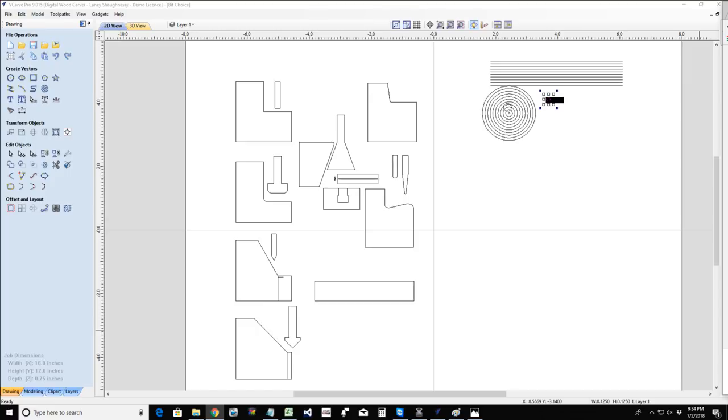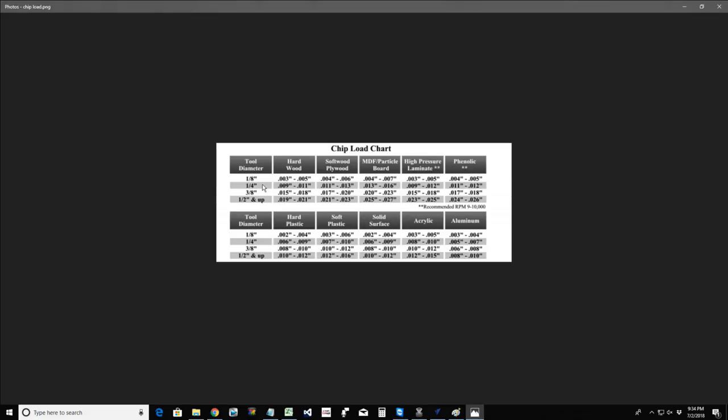Now William, before Chuck, asked the question, does producing chips affect the surface being carved? Yeah, it makes a cleaner cut. You get that nice shear cut. When I say chips, you're not taking chunks, right? You're taking chips, and these chips range from 0.003 of an inch, a human hair, to a little bit bigger, so three human hairs, five human hairs. So these are small chips, and not chunks. So it creates a clean cut.